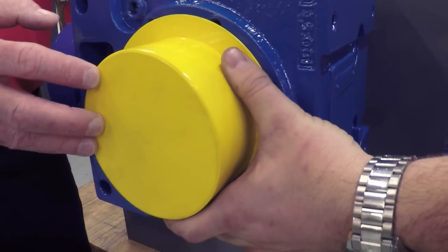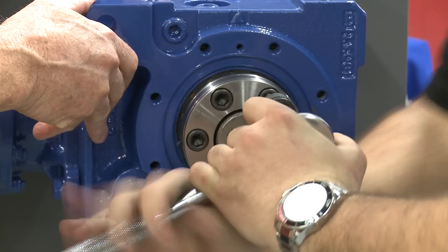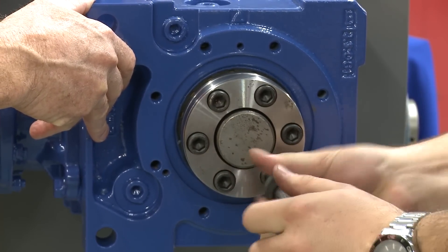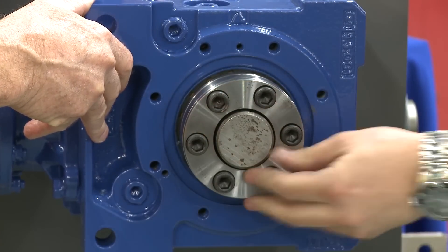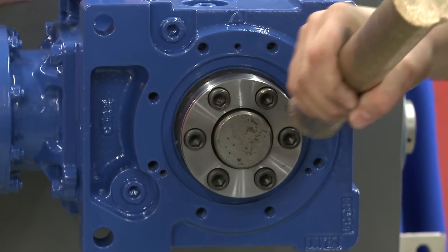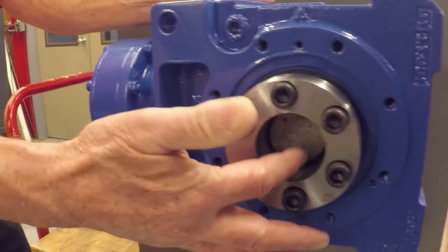So then we're good to go. Now everything is done, but now we need to take it off again — we've got to remove it. Remove our guard, take our cap off, and loosen all six of the bolts just enough so it allows the thrust collar to move, so we know they're all loose. Then the next step, we'll take a brass punch or a brass hammer and hit directly on this face in this direction. One hit or a few hits — it could take a couple — but a few hits and it'll make an audible pop, and it's ready to be removed. Once we make the hit, we can now slide it and remove it off the shaft.